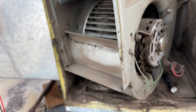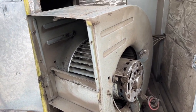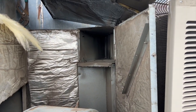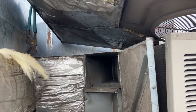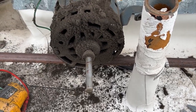Yeah, the windings are completely caked in this stuff, so it probably shorted or something. We got specs, so I'm going to pull the blower motor out and then we'll go from there. Basically you take two screws out and just pull it out - terrible mounting design. Anyway, let's get this blower motor out - motor's toast for sure. We'll see if we can get the specs off of it and see what we have on the truck.